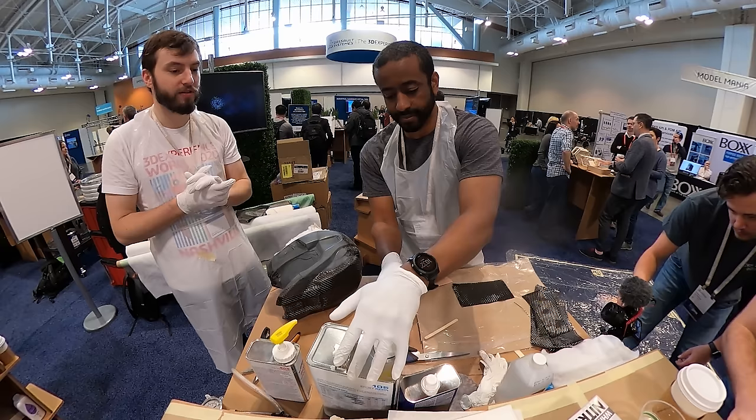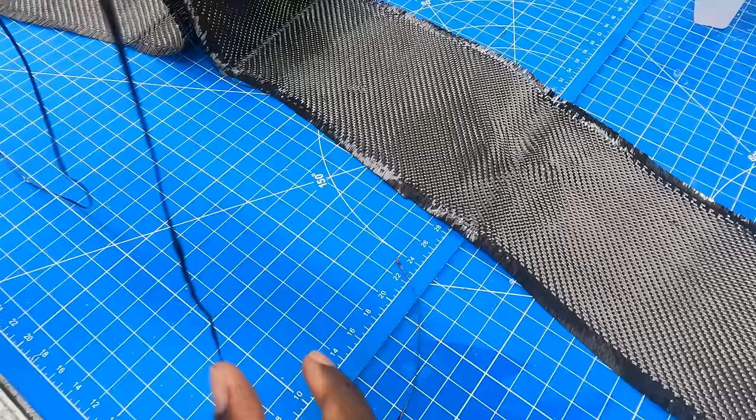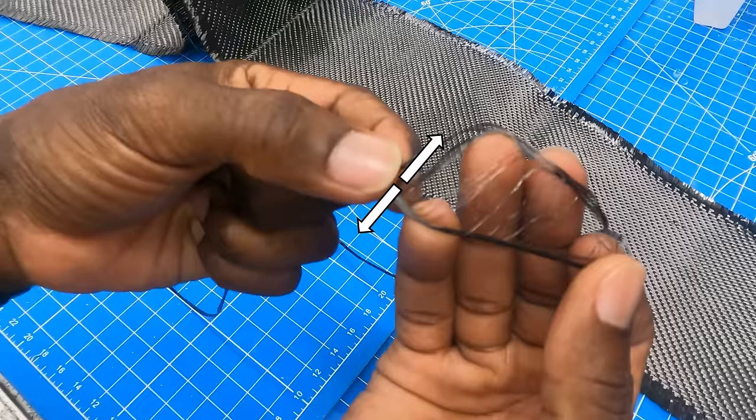You're going to need something to set it in place, and that's usually some type of epoxy resin, which makes the resin part of the strength of the material. It depends on the orientation — if you've got all of the carbon fiber strands going in one direction and you're pulling on the ends, putting it in tension, then all of the stress is on the carbon fiber, making it unbelievably strong. But if you pull it sideways, all of the strength is really in the resin holding the fibers together — that's the weakest part.